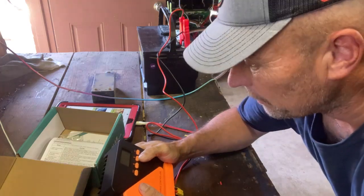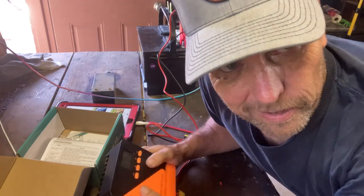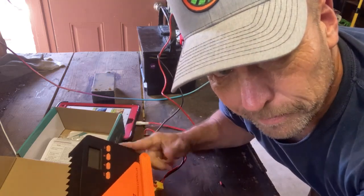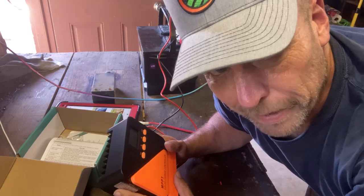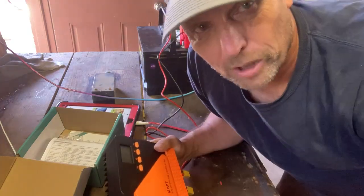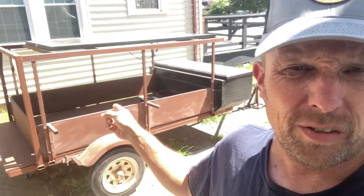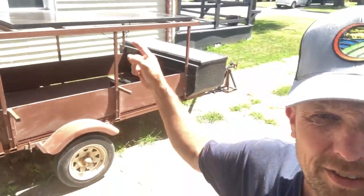Alright, we're ready to go. Let's use the chuck wagon today — we're going to test it out with a 370-watt panel because it's got high voltage coming in and it'll be regulating down, so it'll be a true MPPT test. I already know it's going to work because I saw the gentleman's review — go check that out. We're out here with the chuck wagon I built. It's a little dusty but it's got the 370-watt panel up there. I shouldn't get more than 240 watts out of a 370, which is why it's nice — a little overkill.